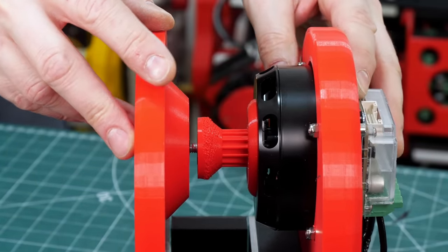So I've got all the batteries in the middle there, and we're going to be running this on around 50 volts. And then the electronics just slot on the middle. And all of this stuff is high up so that we don't get water in it, basically, when we run through the ditch. That's my power distribution, but there is a cover to cover that because 50 volts is actually quite dangerous.